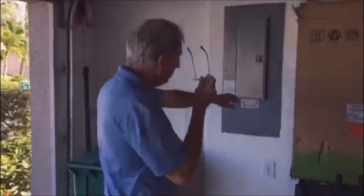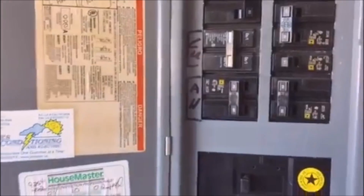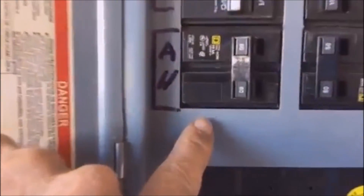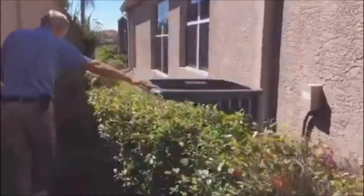In this particular case I'm going to walk outside and look at the outdoor unit. Since he has two-stage cool, he has a common wire out there, the red wire, and Y1 and Y2. Here's the breaker box — we've got it marked. This particular box is what we call a Square D Homeline breaker, kind of like the ITE or the GE, but the Square D product. This is a good brand of panel — Square D QO.